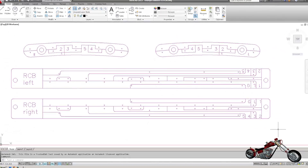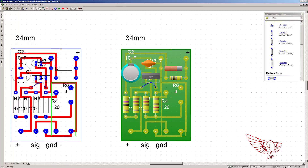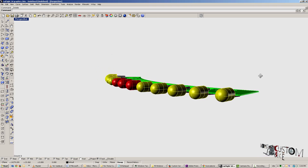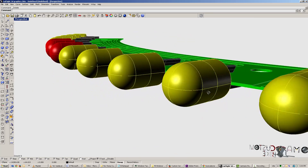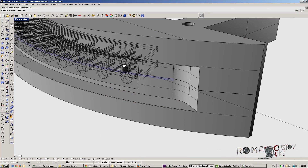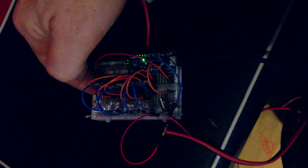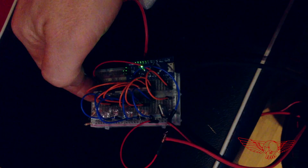Using circuit-designing software, I solved the routing of the connecting tracks so that I could prototype the board. While Sergio kept coding away at all the different software issues, I kept busy designing all the other circuits we'll be needing to power up all the different parts. Among them the circuitry that manages the luminosity of the taillight — high for the stoplight and low for the rest of the time. I also finished up the LED board designed in the last episode, shaped specifically to position all the single LED lights in the right place in the taillight. Meanwhile Sergio finished the first working code and is testing it on a breadboard. The coding is not only in charge of interpreting the signals coming from the turn signal lines, but also manages the timing for the power-up and down of each LED.